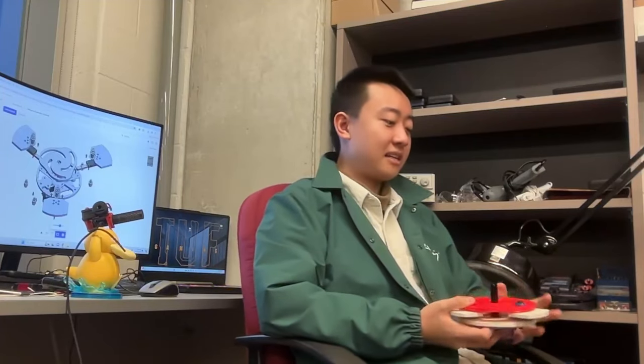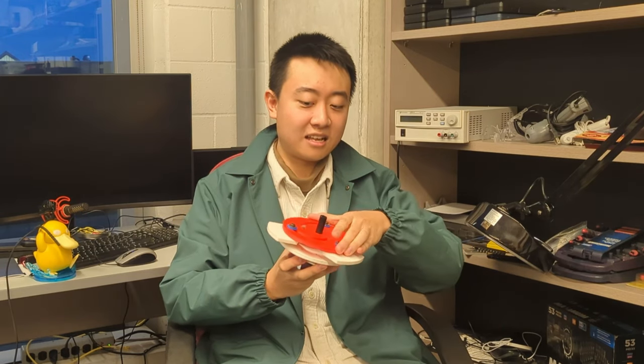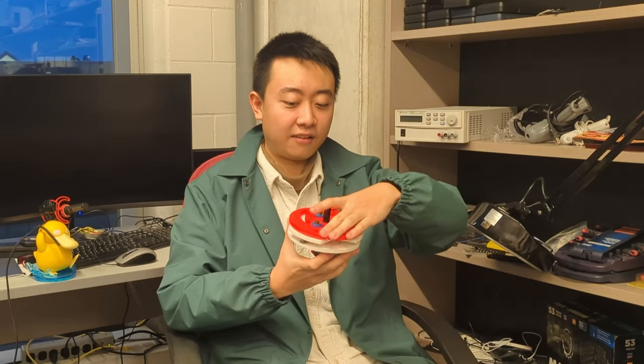programming with Richard, literally. So basically the goal is to reach a target apogee that is as close to the one we reported to the competition as possible. And how we do this is we have this set of airbrakes which have three fins. Those white parts of the fins will stick out to the outside of the rocket throughout flight, and they will change in dimensions. So if the airbrake rotates, it will retract all the fins, and if it rotates the other way, it will expand all the fins. With this, we will have airflow directly hitting the top of the airbrakes, which creates additional drag onto the body of the rocket, and this will effectively slow down the entire rocket. So with this, we can constantly calculate during the flight how high the rocket will fly to. And if we are predicting that we'll overshoot our target apogee, we can extend the airbrakes by a certain amount dynamically throughout the flight in order to bring the rocket to the target.